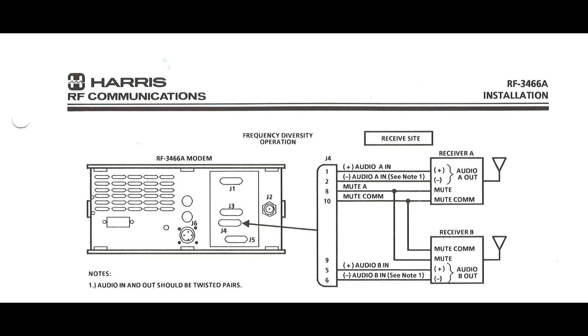I have no intentions of using two transmitters for the purposes of transmitting RTTY. However, there could be some benefit to building up this system to allow a second receiver. For an amateur, this could mean two receivers on the same frequency using two different antennas — maybe one horizontal and one a loop. By setting up this modem for diversity reception, the system will determine which antenna has the best signal-to-noise ratio and use that channel, or combine them for an overall improved SNR. This could help protect against QSB, selective fading, or conditions where one antenna is favored over the other. Another potential use is to use one receiver for channel A and any number of web-based SDRs as the audio for channel B — the system will use the best of the two signals at any given moment.